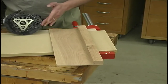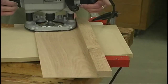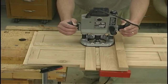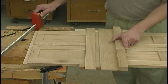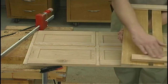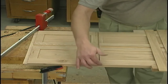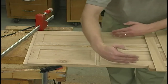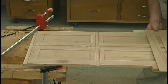Now we need to trim up the platform to the width equal to the distance from the edge of the router base to the edge of the router bit — using the same bit you'll be cutting your dados with. I was careful not to put brads in the area I'll be cutting as I trim this up. I also added one more feature — an extra cleat at the back. Without support there, you'd get chip-out on the outside edges. It's just tacked in with brads rather than glued, so if there's any variation in width, I can overcome those brads a little with clamping force. Then it's just a matter of indexing it along, lining it up with your layout marks, and taking the cut.